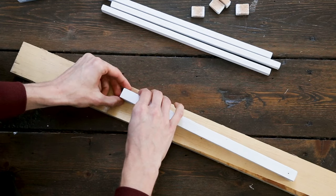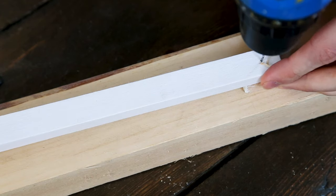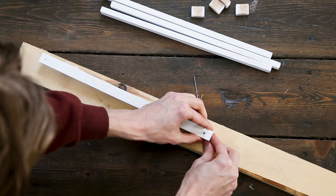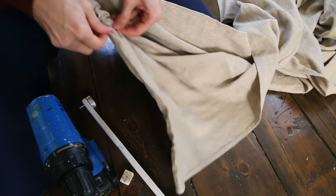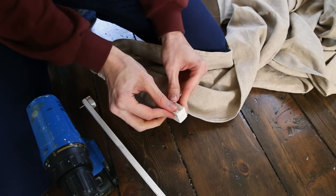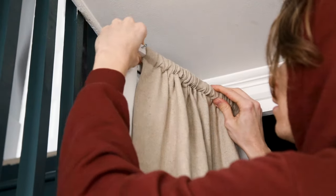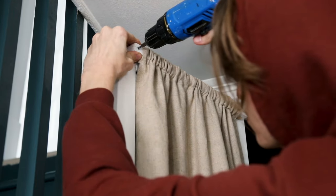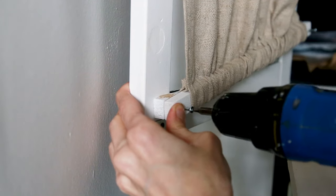Step four: installation. I drilled both edges of the rod with a little piece of wood underneath and screwed one side so they stay together. I put the curtain on and screwed the other side, then repeated the process for all four sides. To install it on the door, I started from the top, poked the surface with the screws and drilled where the screws left little holes, then screwed the rod on the door. I did the same for the bottom rod, except I really pulled on it so the fabric would be stretched to make nice folds.